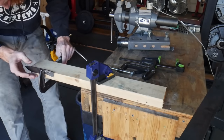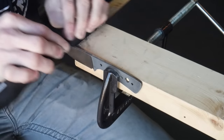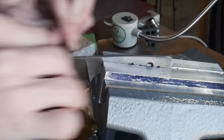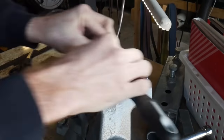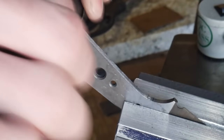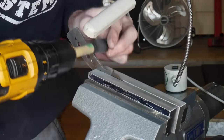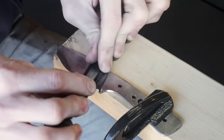After we finish the flats on the handle portion of our blank, we will finish sanding the rest of the blade. If you want a nice straight crisp line, use a hard file behind your sandpaper; if you want to wash out your lines and smooth everything over, use a rubber backing. The smoother softer backing is good once you get into the higher grits, while hard backing keeps everything nice and crisp in the lower grits. For this demonstration I only brought the blade up to a 120-grit finish; however, a 600-grit finish is a good standard for a nice hand-sanded satin finish.